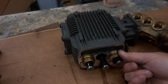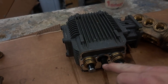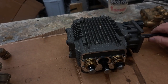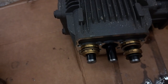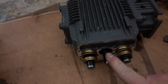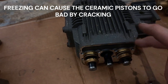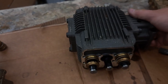On the actual pump, here are your pistons — one, two, three. It's a three-cylinder pump. You can see the piston with the retainer and the packings. Now this crank over here: when it's rotated you can see your pistons are moving in and out, just like in a car engine. Some of these pistons are steel and some are ceramic. When they get wear on them it's no longer a smooth surface, the seals lose compression, and you will lose pressure.